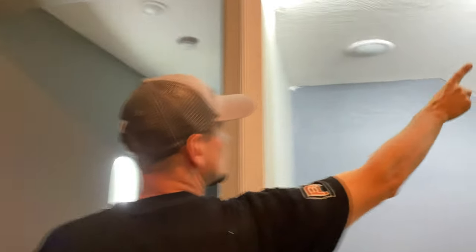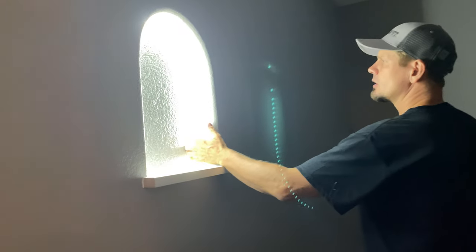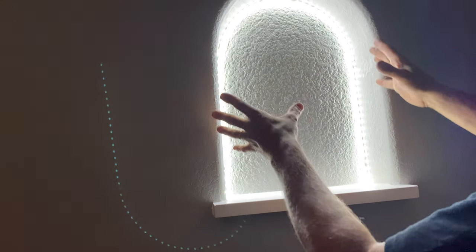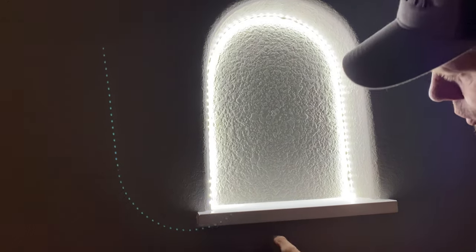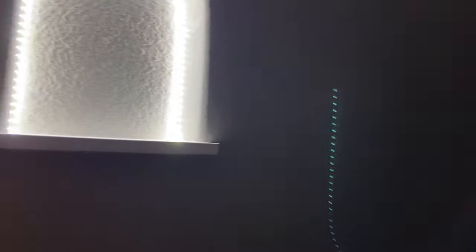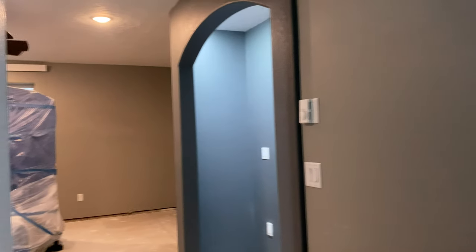This is probably my favorite part of the job — I love doing LED indirect lighting tape. I did it right in there and right up here. There is a difference between cool versus warm white; it's more difficult to get them warm, but the cool turned out really well. I like these niches — he bought this at Home Depot. In my rough video it was a purple niche already designed there. They were really smart — they left me a gap of three inches, put two little pieces of wood there, and I could slide it flat, make up all my connections. You can see these three areas lit up indirectly — very, very nice feature.